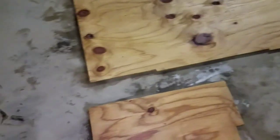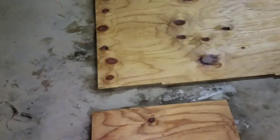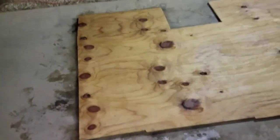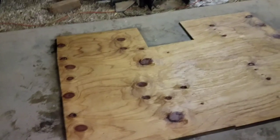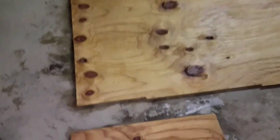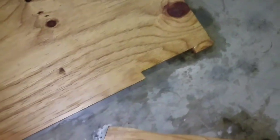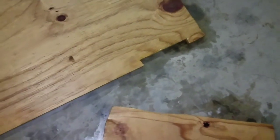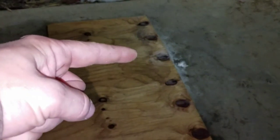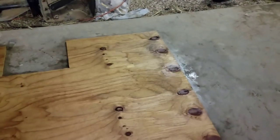You could see where I was talking about earlier — I do a little bit of fabricating. It was hard because I couldn't get this thing out once I got it in, at least not by myself, so I was sticking a block of wood under parts of the stringers just to hold it off. Then going real carefully with the saw — also had a little bit of a step-up cut — but it fits to where the smallest gap now is a quarter inch right there. Had to taper it a little bit on the sides, and that also helped it come out once I was done.